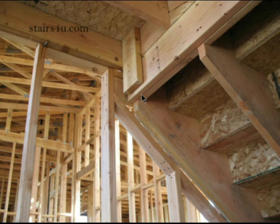I don't have a drawing to show exactly what I'm talking about, but if you could just imagine running the head out another 3.5 inches into this wall area here, and then placing a support post underneath it, then you realistically wouldn't have needed the cleats and you would have had a nice structural connection.